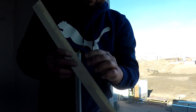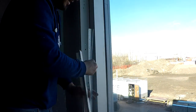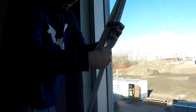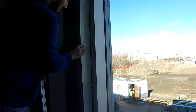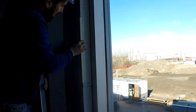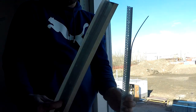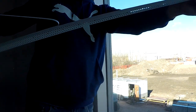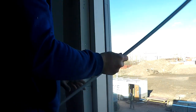The corner bead has aluminum on the inside for a hard corner and paper on the ends. A lot of times you can spray-glue this stuff — spray the drywall and the tear away or corner bead, let it tack up, then pinch it on. But today we're drywalling, so getting in the corner bead and tear away — just like that.